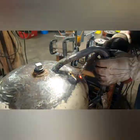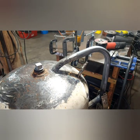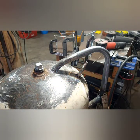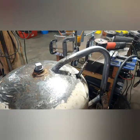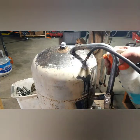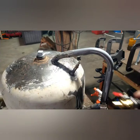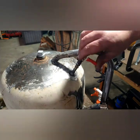This thin little pipe piece actually welded on pretty well — I was kind of surprised. Sometimes I blow through thin stuff and I was half expecting to, but I didn't. I tried to get as thorough a job as possible to avoid any leaks, and sometimes I'll even smear JB Weld on over top of my weld after, just for extra security. I'm checking for leaks with a black hose and some water mixed with dish soap — everything looks good. I had a quarter-turn ball valve and a black piece of fuel line, so I stuck it on there. It works great as a vent.